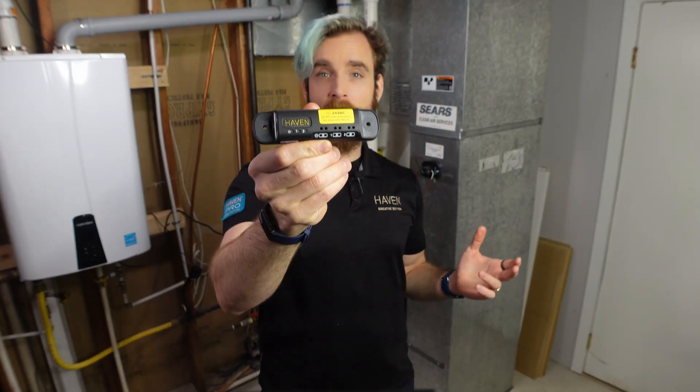The CAC is a low powered product, only using 10 watts during startup and a few watts during operation. It can often be powered by the R and the C terminals from the air handler control board.